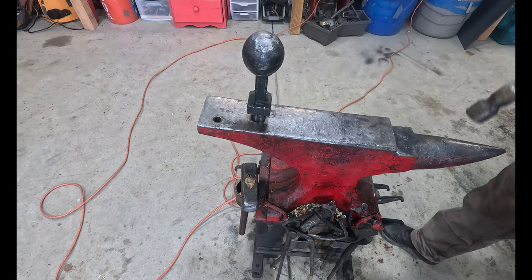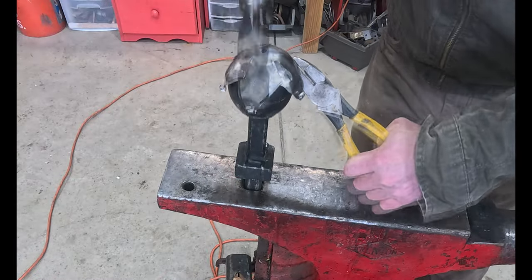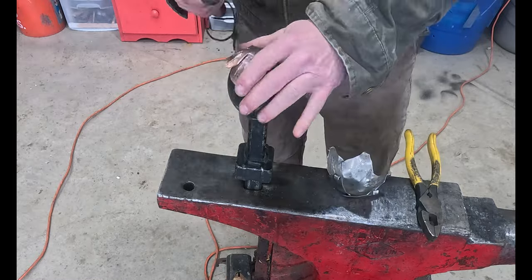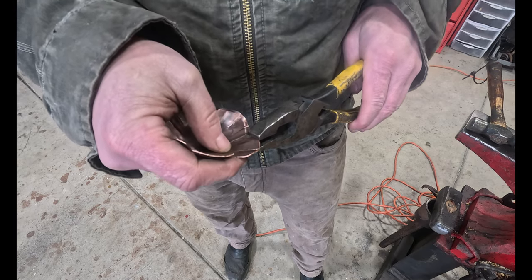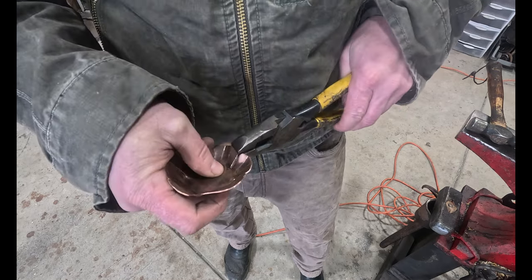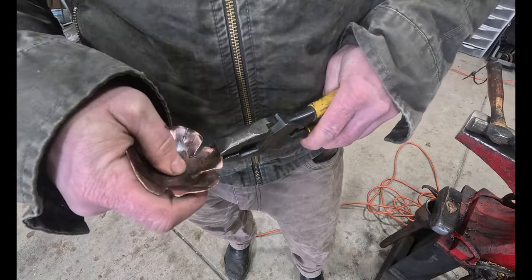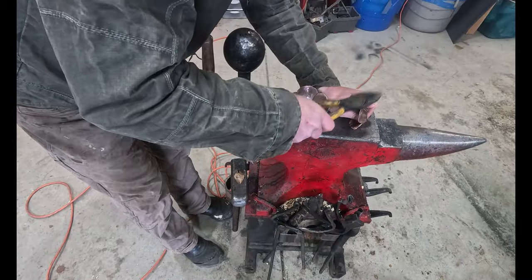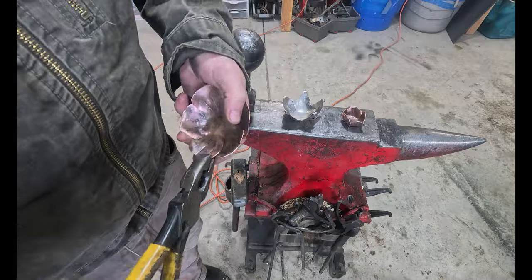I made this little ball tool that you insert into either the swage block or the anvil, just to help with rounding things over. It was actually a great fit on this — it just rounded everything into a uniform shape, and then I could collapse each one of them down a little bit further. And here I'm taking the very tips of each petal and rounding them out, to give the look of how the outer extensions of the petals actually pull out as they climb upward and inward.